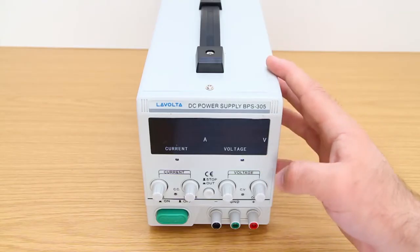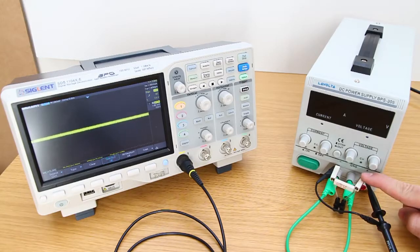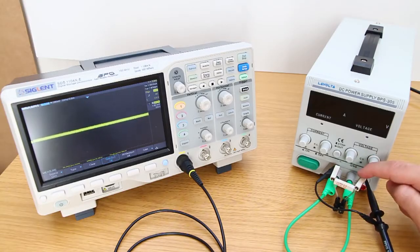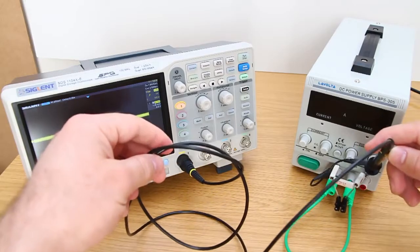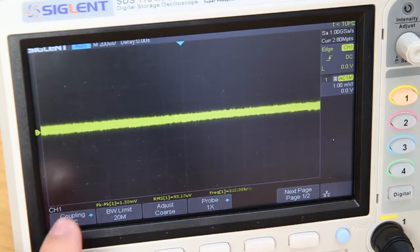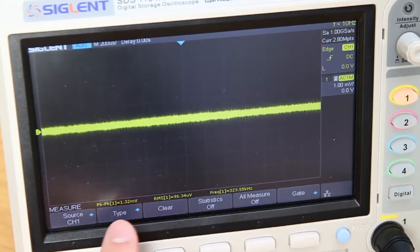First, let's try to fix the ripple so it's actually usable. I'm going to set up the ripple measurement the same way I did in the previous ripple comparison video — check that out if you missed it. For a load I'm using these three 5-watt power resistors connected in series, which I can load up to 1 amp at roughly 14.3 volts. I'm using this lead to tie the negative output terminal to ground, since this power supply didn't come with a ground bar. I'm measuring the ripple with a single one-to-one probe — not the best way, but the best I can do right now. The oscilloscope is set to AC coupling, bandwidth limit 20 megahertz, acquisition set to peak detect, with measurements for frequency, RMS value, and peak-to-peak value.